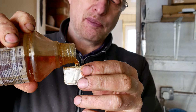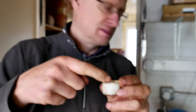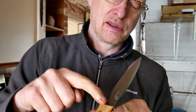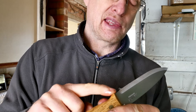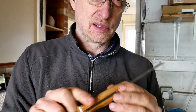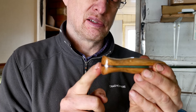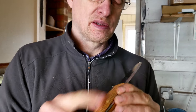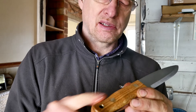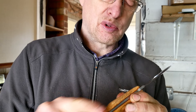Just pour a tiny amount, and get your finger and your knife, and just rub it in — especially into the end grain. Rub it all the way round, obviously paying attention not to put your finger anywhere near the actual blade. Get the end grain on the pommel as well. This knife doesn't really need it now because it's been done, but this is what I would do. It's not something you can really overdo, but it's something I would do maybe once a month, or whenever you think the wood's beginning to look a bit tired.